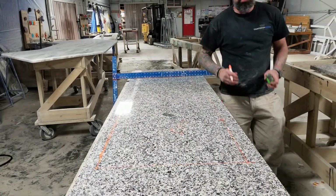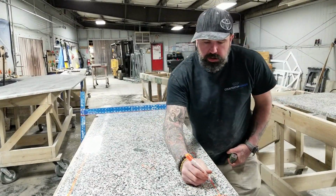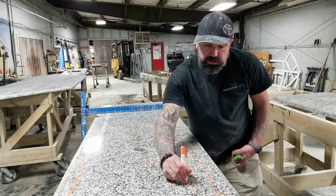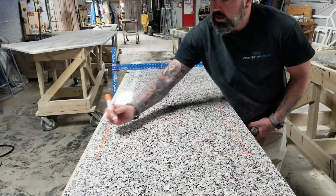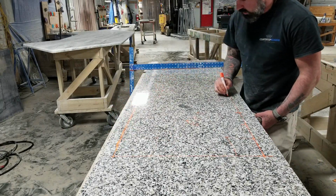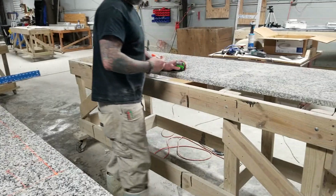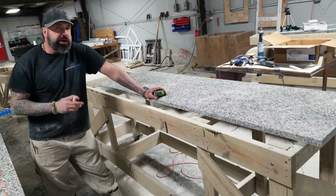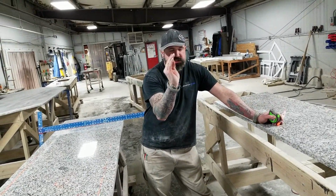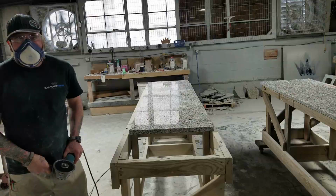So at this point, I'm going to get my grinder, put my mask on, turn my fans on. This one here I'm going to block. I'm going to cut it all the way through from here to about here. Then I'm going to block it here and here. I'll leave this meat. I'll cut it all the way through here. I'll leave meat here. I'll block it here and here. These here, I'll just cut in a circle and I will drop it all the way through. And I'll show you how to cut these circles with a straight blade. They sell a concave blade that's thicker, but I'll show you how to do it with a straight blade as well.